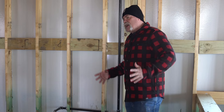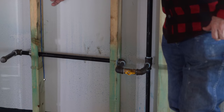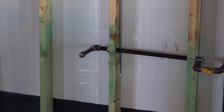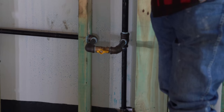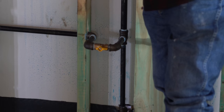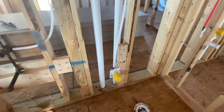Here's another thing that makes this a good top out — I love how they did the gas under the range. They've got the stub out where the valve is, then it goes back in the wall and comes out directly under the range. You put your regulator there and tie directly in — you don't need the regulator, valve, and everything else off to the side. That makes it great for the homeowner. And after that they've got a tee that stubs out, so outside you've got a gas outlet for an outdoor grill or anything you want.